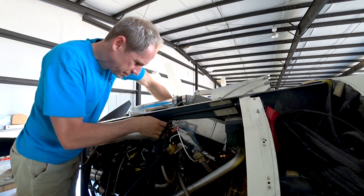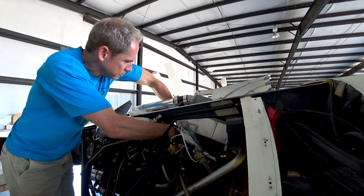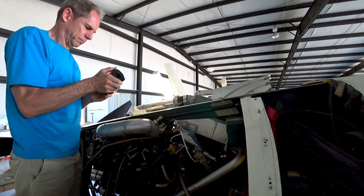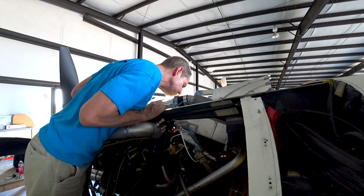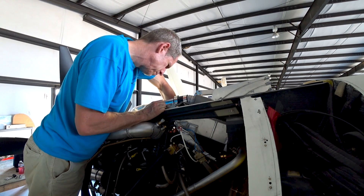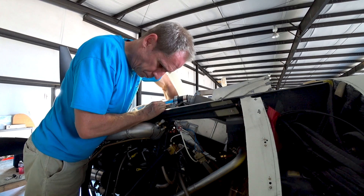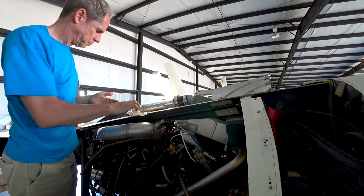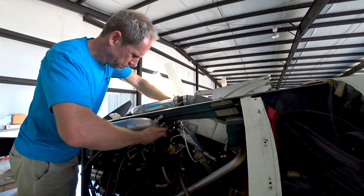Here I am just trying to get the lid off, and a couple minutes later I managed to get it out — it's a little tight and I had to move some hoses back there. This time, instead of putting the lid on with the filter in it, I took the filter off. You can see the little tab on the bottom sticking out, and I looked to see where the hole is, then lined it up and put it down in there. Rotate it around and you can feel when it goes into that hole. I just made sure it was seated nicely — once it was in, it wouldn't rotate anymore — and then put the cap back on and tightened it down.